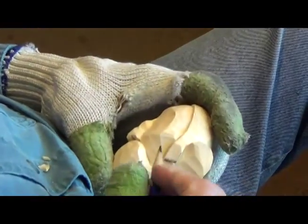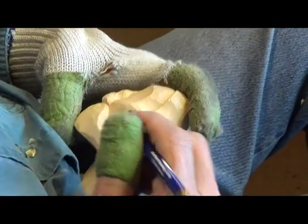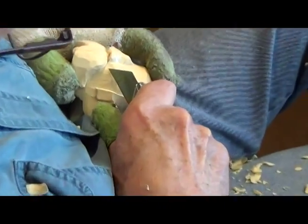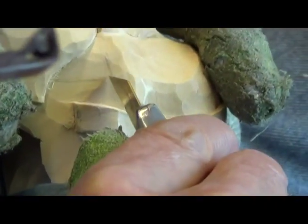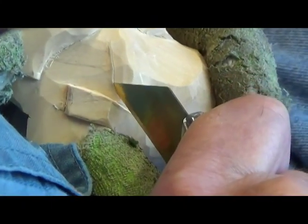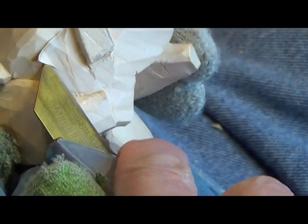Now getting back to the indentation on the side of the face. Draw a mark like that and draw just sort of a T with a sloped top, just like that. This is going to add a lot of character to your face. So I'm going to start out here and as I go across I'm going to dig a little deeper towards this spot and then come out shallow again up here. There you can see my knife blade go in and come back out again. Now starting up here I'm going to come down like that, then go over here and come down like that, and take that chip out of there. Kind of whittle away those sharp lines, especially on the top there.